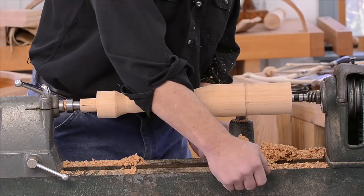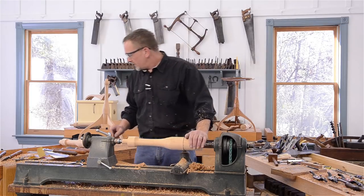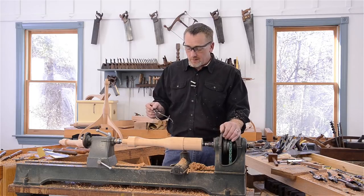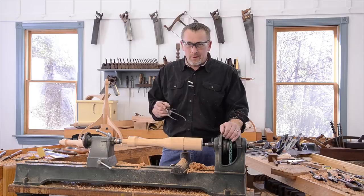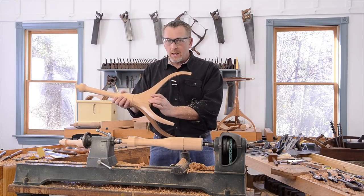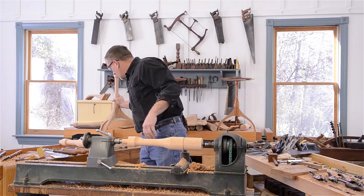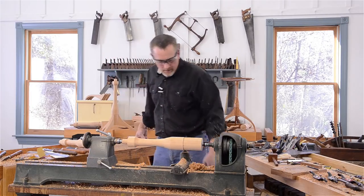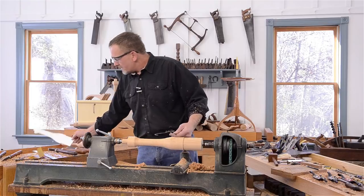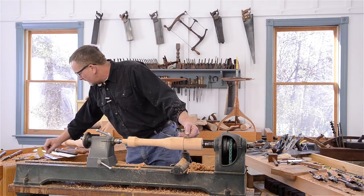As I've probably already proved, I'm not a great turner — I just don't do a whole lot of it, but I can get by. Fortunately, this is a pretty easy, simple turning. The only part that's really critical is right here where the legs meet the spindle — it needs to be straight and a cylinder all the way down. To start with, I'm going to use calipers set to two and nine-sixteenths. That measurement will be on the patterns available on the website. We'll start with a parting tool.